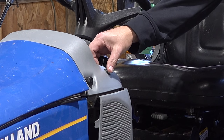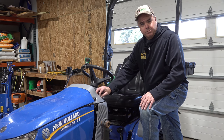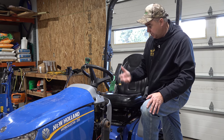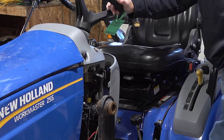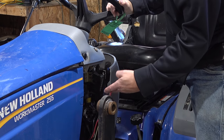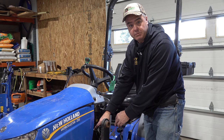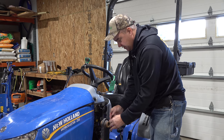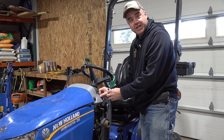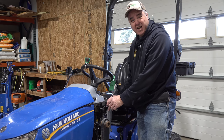I saw this switch and it's broken. I was trying to figure out what it actually switches — and I began to realize it didn't seem to be part of the factory tractor. I decided to take off this shield. Removing a shield like this sometimes can really help you see behind. In this case, there's a whole bunch of wire. I look closely and here's a ground wire that goes to the battery. The battery's right here, and I notice it's got a brand-new battery in it — so the seller has just recently replaced the battery, which is a good thing, but they didn't reattach all the wires.